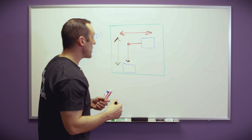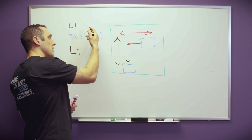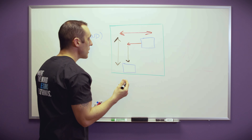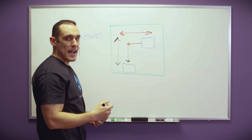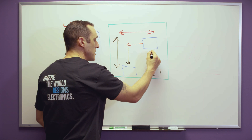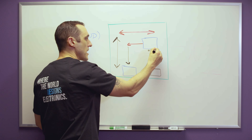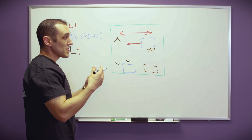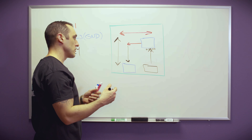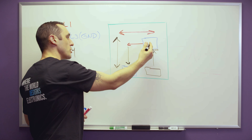It's not always easy to implement on every PCB, as we saw earlier. However, with a layer stack where L2 and L3 are ground and L1 and L4 are signal, you can set up these routing directions and keep the signals isolated from each other at the same time. Planning this out and sticking to it everywhere isn't always perfect or possible, but it lets you set up channels so things stay organized and traces don't route around and over each other to reach between different components.